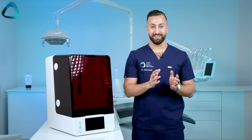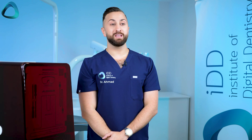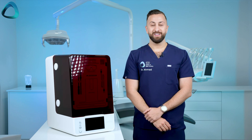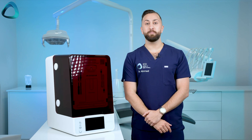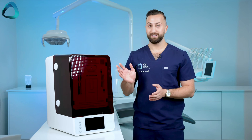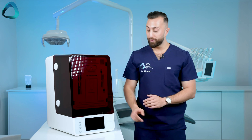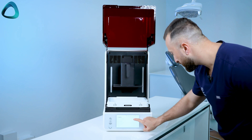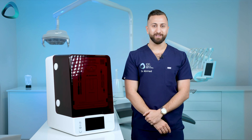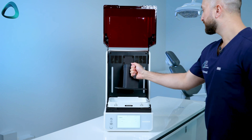Build platform size aside, one really cool quality-of-life feature that Asiga introduced with these printers — which, from my understanding, is a first of its kind in dental 3D printing — is making the build platform electromagnetic. The company has built electromagnets into the build platform holder, so there are no more knobs or dials to tighten to secure the build platform. Instead, you toggle lock and unlock right through the LCD screen. When it's locked, it's next to impossible to pull off — a super tight hold — and when you toggle it unlocked, it comes off very easily. It's actually quite a cool feature.